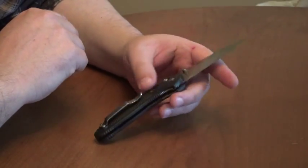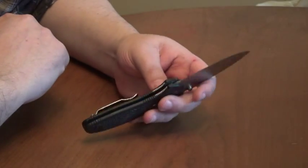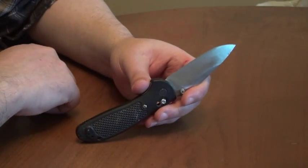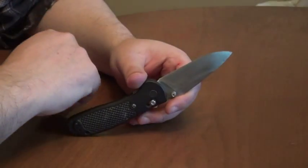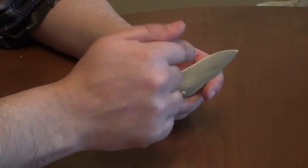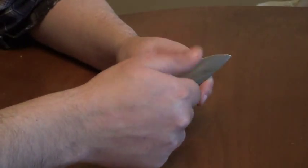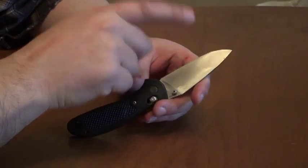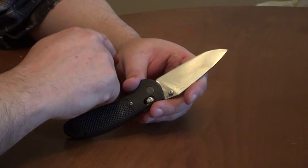The problem was that for a lot of these companies, these knives were the very first knives they produced in a very high vanadium steel — so very low grindability. All of a sudden, people who were used to steels that were much easier to grind were putting S30V blades on grinders and they weren't reacting as well. It was taking longer to grind, so essentially they just pushed harder into the belts, generating more heat and damaging the edge. The common solution was to jam the knife in a bucket of water to cool it down — but now you've overheated the edge and quenched it in water, which these steels are not meant for. So you've not only weakened the edge by overheating it, you've also destroyed the durability by micro-cracking it. This also explains why so many people had problems with S60V, the precursor to S30V, since S60V is even worse in terms of grindability — those blades were most likely overheated as well.